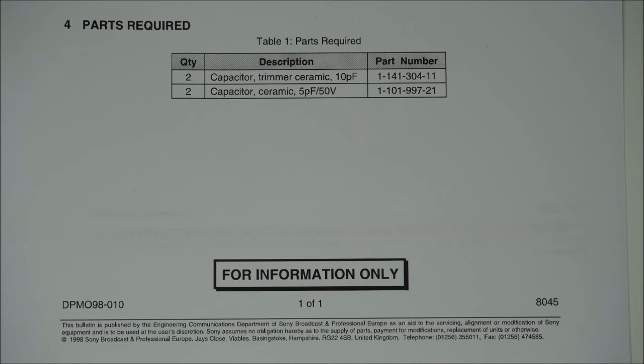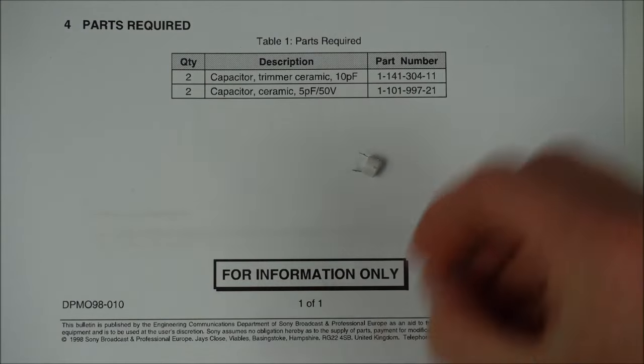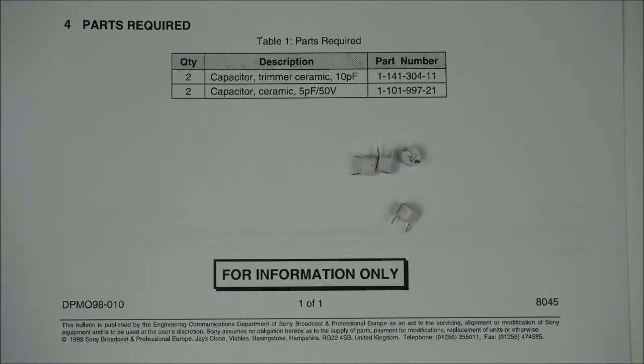The trickier part, if I can say such a thing, are the adjustable trimmer capacitors. What I use are these ones from RS Online. There's a tub full of them there. The part number, which is in the description below, is, well, RS Online stock number is 1753544. The value is adjustable, but it's between 3 and 10 picofarads at 100 volts.